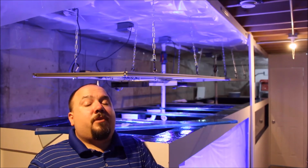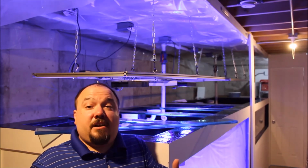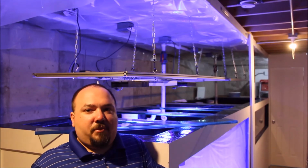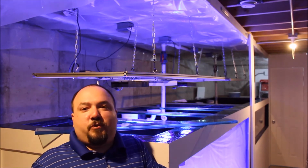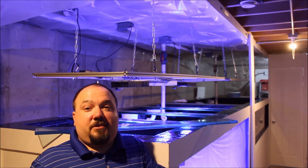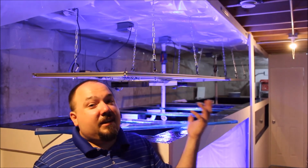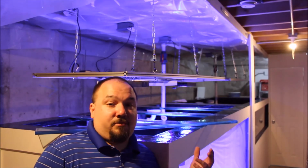I got to go through my reverse osmosis system. I did pressure test the unit I have today, despite the fact of it needing all its cartridges and membrane replaced, just to get an idea of my house water pressure, and I'm only pushing 40 psi, so I'm going to need to get a booster pump. There's no question about that. There will be a booster pump getting installed on the RO system, which is not going to get put into the fish room because obviously it's very filled up with all kinds of support tanks right now.